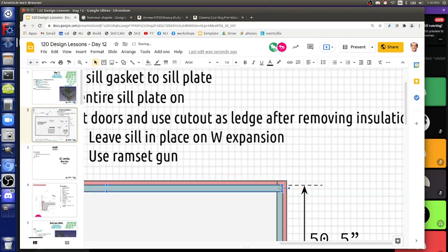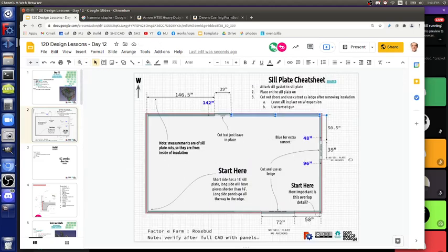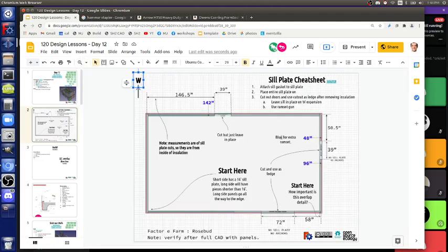So this thing on the corner, what are we looking at here? This is the top view. Normally we look at the house from the front, so the lengthwise goes north and south. If you see that direction arrow there, W, that's west, so north is to the right. Say you start at any of these corners. What is the blue and what is the red again? Remember, the blue is the sill plate, and the red is the insulation. Out there we have the white insulation. It's not pink, it's the white stuff. The insulation goes outside, so this sill plate goes inside the insulation, just on the concrete. The detail is here.